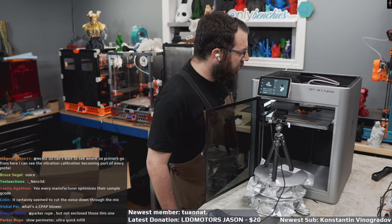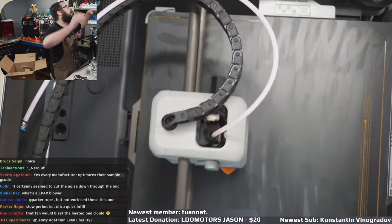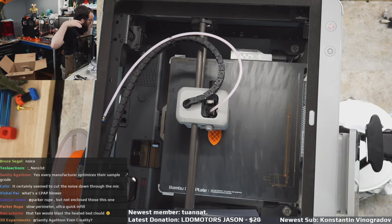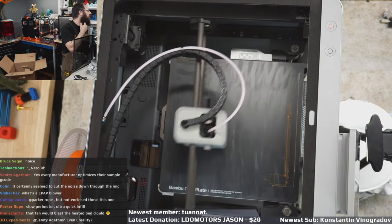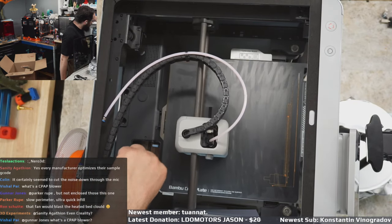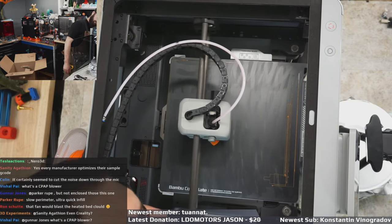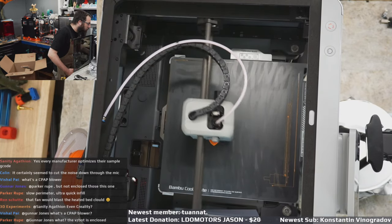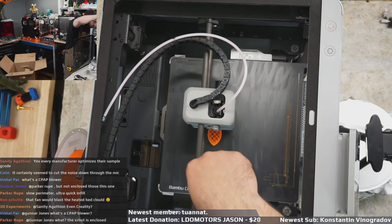It looks pretty solid. There's an internal structure of the printer, like an external frame skeleton that is steel, and everything's bolted to that. The motor mounts are either glass filled nylon, or I think they're glass filled nylon. Kind of hard to say. Motors are slightly warm. It's 2GT belt. I don't know what brand. It doesn't say, it just says 2GT on the belt. Your X rods are carbon fiber.